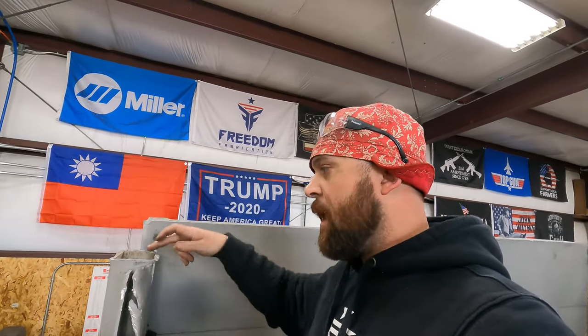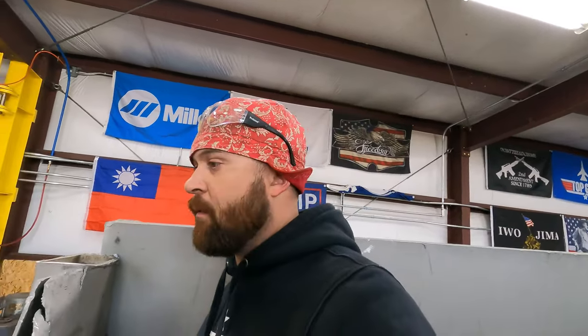I mean, there's always more involved with equipment than usual. And when you have a customer that's worried about how much it's gonna cost or what the time is, that tends to complicate things. So anyway, I'm gonna run a fairly tight open corner here, weld the whole thing solid, and then we'll get it to where the hinge can be on here. We want this to be as level as possible. So anyway, that's where we're at.